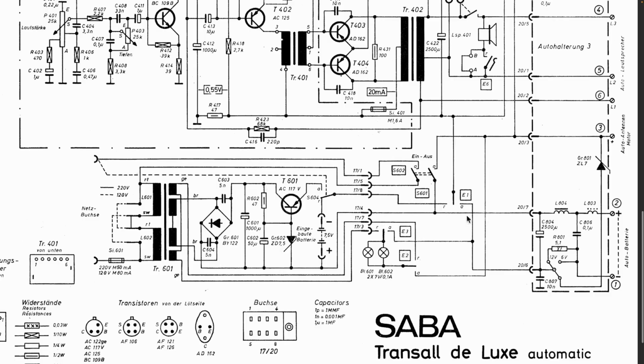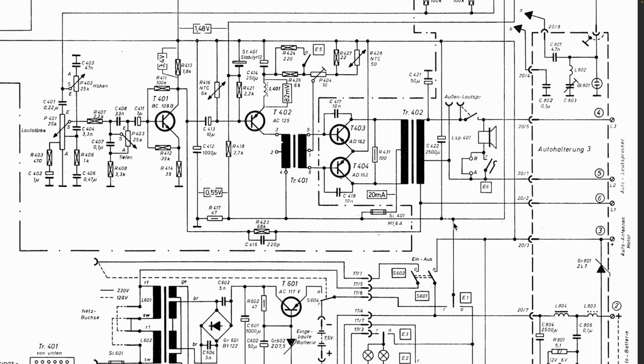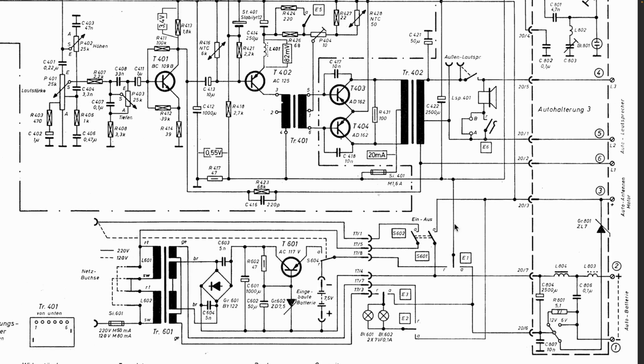And then what we've got going up is the positive voltage through that switch, and the negative through that switch, whatever that switch is. It then goes up to here. I'm not sure if the negative is actually, oh, it is. I was looking for ground earlier on. There's our negative of the battery, right? Goes up here, goes up here. And I was trying to find out how this point connects to one of those ground, chassis ground, and I found it.